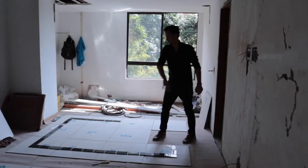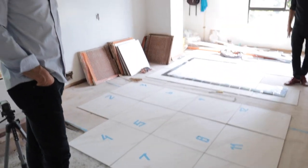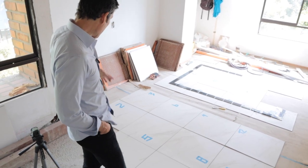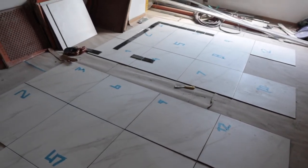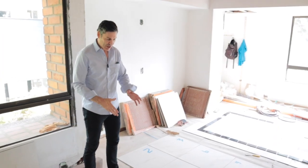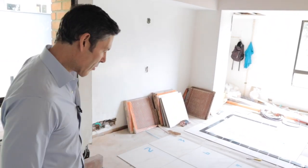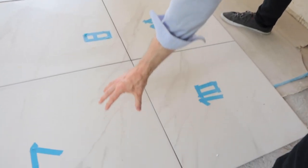Then we went into the master room and actually laid out each piece of tile so it looks like a puzzle. We do that so the tile looks as good as it possibly can. Each piece comes with a different pattern. What amateurs do is just hand the packets to the tile guy and say go nuts. Since each piece has a different pattern, if you just put them together randomly it can look very odd and unnatural — not like one piece of marble. It'd look tacky and cheap. So we put all the pieces on the ground and have the guys arrange them so the veins in the marble line up.